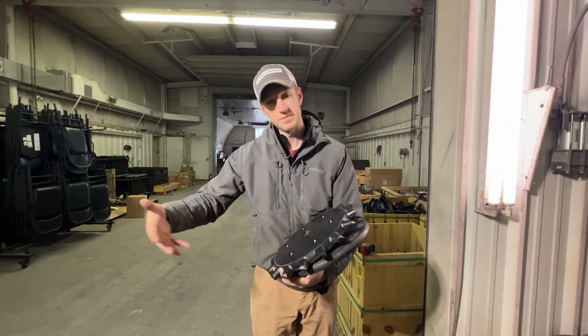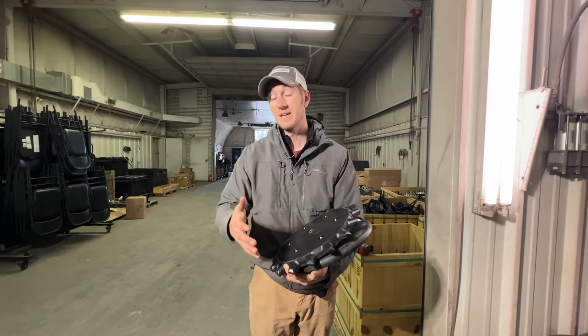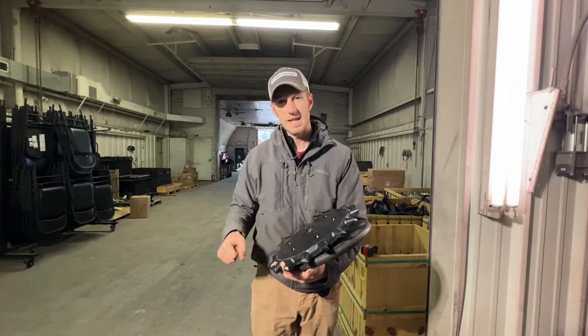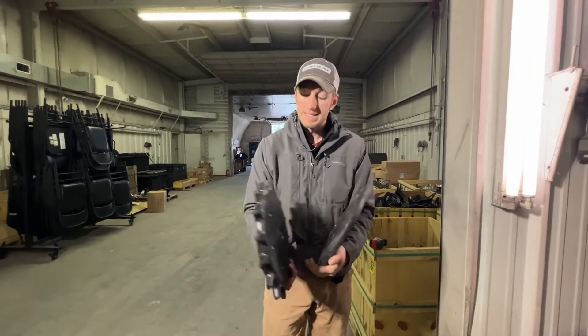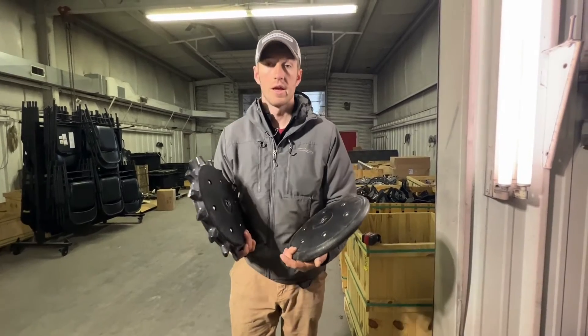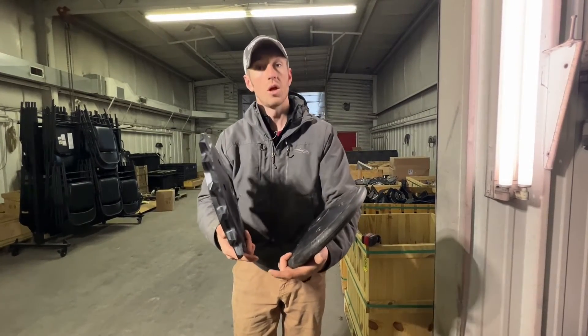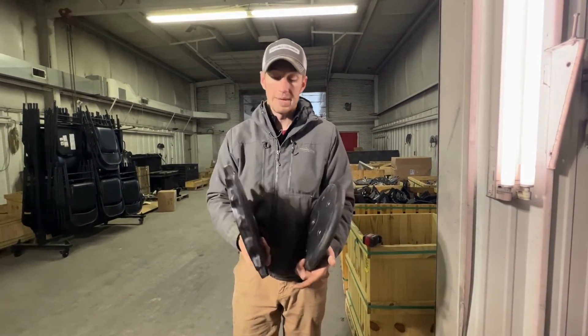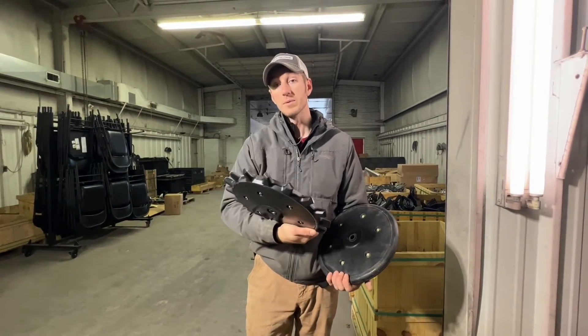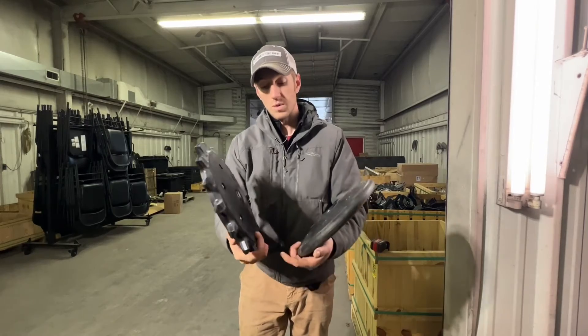We're taking a less aggressive approach with these poly twisters rather than those real aggressive spikes we used to run. We used to run one of them per side, or per row, all the time, but they were super aggressive and we were closing from the outside in — and we had a lot of issues, maybe some throwing of seed or just excess down pressure on that tailpiece. But today I like to run two of these with very little down pressure. It's just a gentle close, and we need that coming from each side.